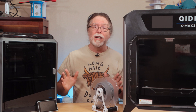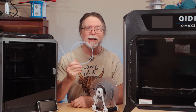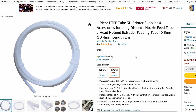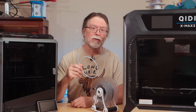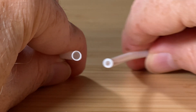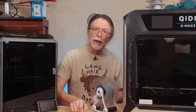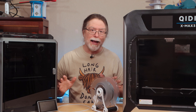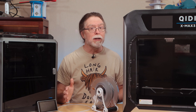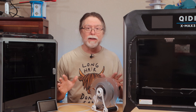That's only half of the fix. The other half is this plain old PTFE tubing that's super common in 3D printing. A one meter length of this is well under 10 bucks on Amazon, and it's enough for two or three printers — there's a link in the description. This particular tubing has a three millimeter inside diameter instead of the usual two millimeter inside diameter. The printer's going to be pulling filament through it, so I just want it to have a relaxed, comfortable fit — that's just my personal preference. If you already have the usual kind with the two millimeter inside diameter and four millimeter outside diameter, that is definitely fine.